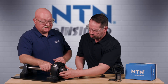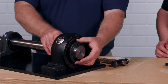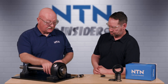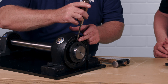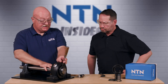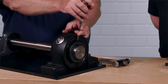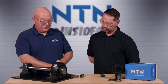We're going to seat that bearing into a positive position. We'll back the nut off just slightly from the bearing face, then take a wedge or screwdriver and go between the nut face and the bearing itself. If the sleeve is not seated, it will pull forward when I put a little bit of pressure on this. If it is seated properly, it won't move at all. It did move just ever so slightly, so we'll snug it back up into place.